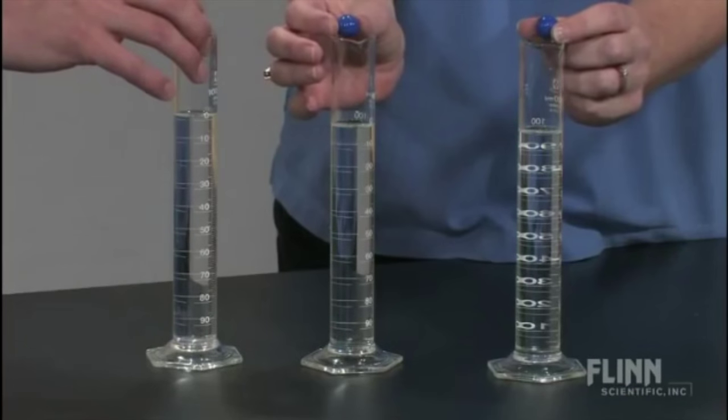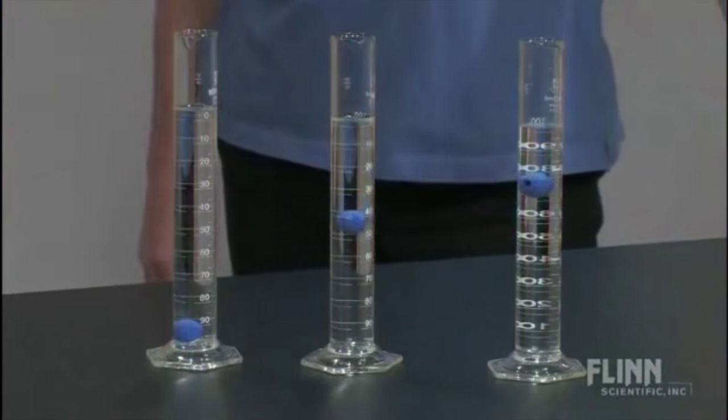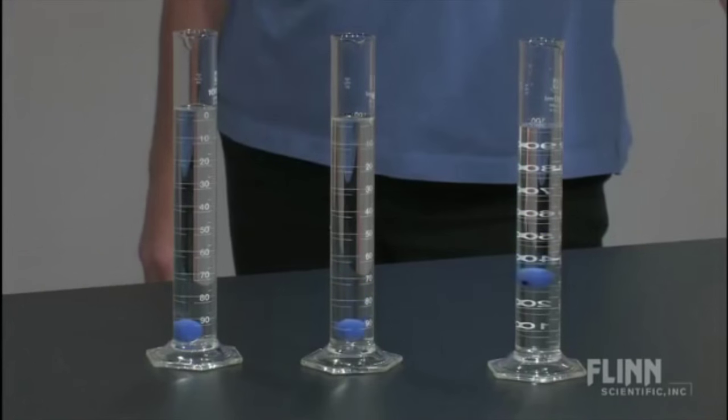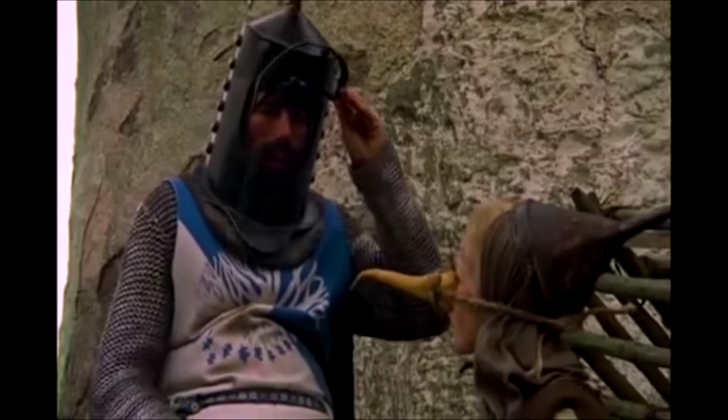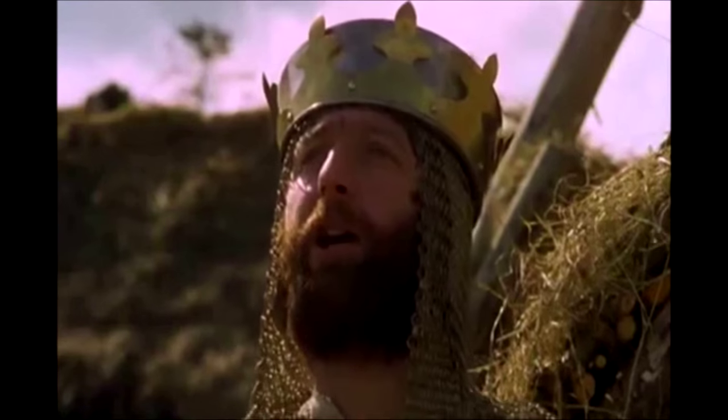When PCL melts, it turns from solid into liquid. A very viscous liquid, but with about the same density as water. That means things that float on water also float on PCL. What also floats in water? A duck! Yes, but what I was about to say is that sawdust floats on PCL, okay?